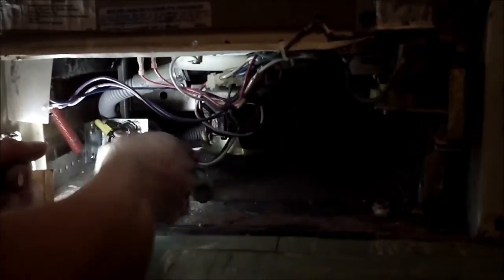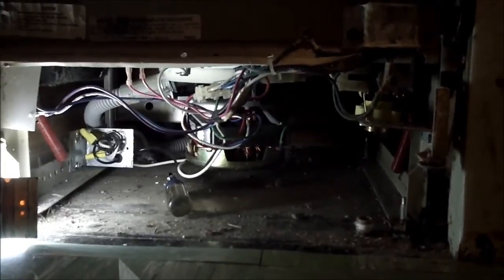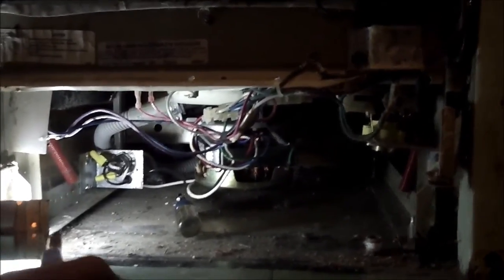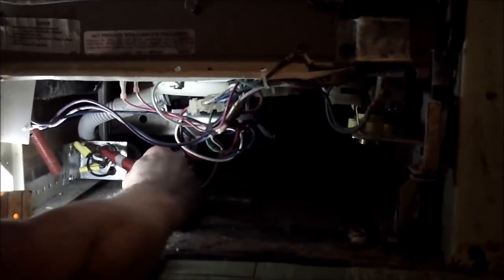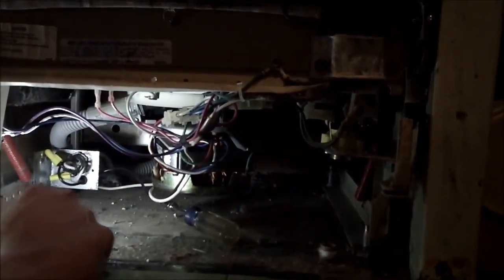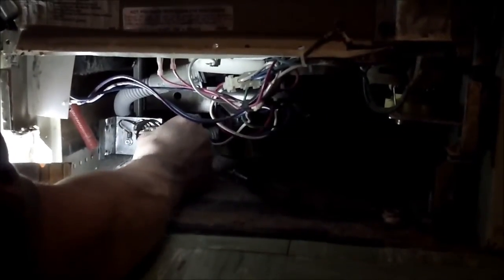So we'll do the electrical disconnection after shutting off the power. It's always a good idea while you're getting your electrical work done to check it with a meter, or sometimes these here work pretty good. A meter is always better. So I've checked that, and I'm getting little beeps from static electricity. Since we've got the number on the breaker panel was clear, and I know that it was put in with a dedicated circuit, we're okay. But if you're not sure, always check, because